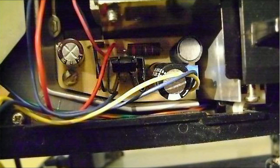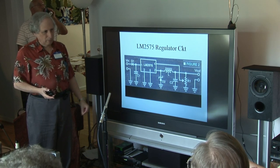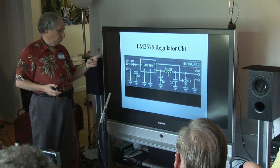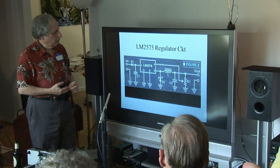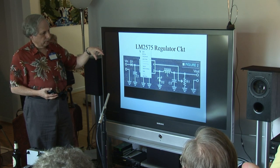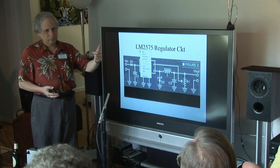The circuit is an LM2576, a TO220 switching regulator. I'm dropping 17 volts down to about three and a half volts. At 700 milliamps that would be a lot of wattage, but this thing runs so cool you almost don't need a heat sink. I added a series one-ohm resistor to act as a shunt for measuring current. I also added a second pot in series with the published schematic so I could set the maximum voltage to give me the current limit I wanted — I set it at 500 milliamps, since I don't like to run anything full blast. Now I have a front panel control where I can vary it from zero to full brightness.